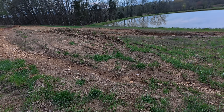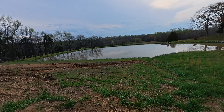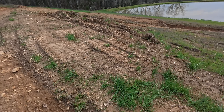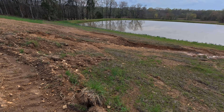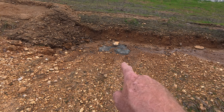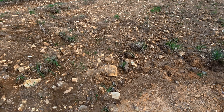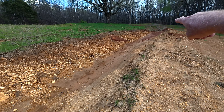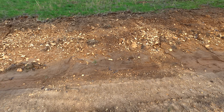Here's our pond — it's looking pretty good. We're having some issues with our dock; it's sinking. One of my ditches that was dug 20 years ago is eroding badly. You can see the coal shale under there — if you touch that with a lighter it'll start to smoke and smell like oil, like an oily shale. What I've been doing is restructuring the ditch: I moved it up and shallowed the angle — down to two percent grade, which means it will run but it won't erode.